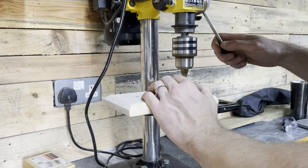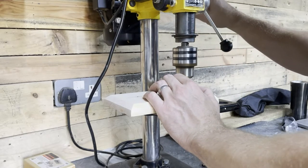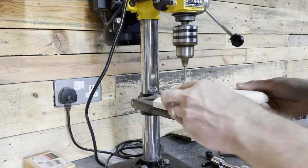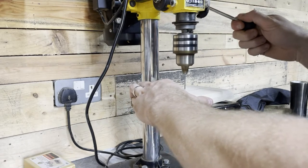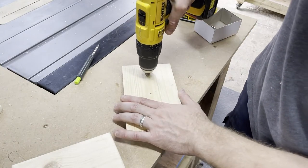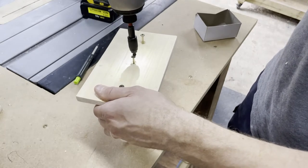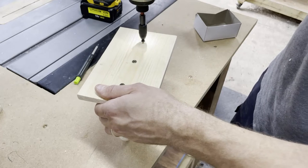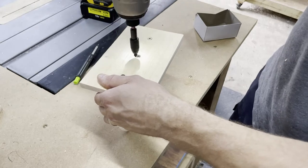I then took the opportunity to use the drill press that my dad recently gave me. I really didn't need to use it just to drill three holes in each backer plate as you can do it with a standard drill, but I've been itching for a reason to use it and this seemed as good a chance as any. On the back of the backer plates I added a countersink to each hole so my screws would sit flush when it was put onto the wall. Then I drove some screws in through the backer plate and into the shelves themselves. The shelves only measure about 100 millimetres so three screws should be plenty, even for my fat cat.